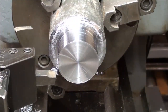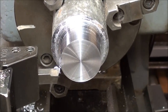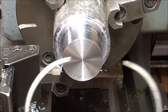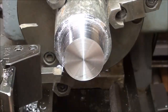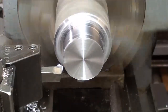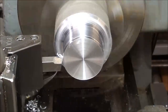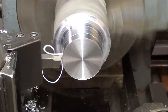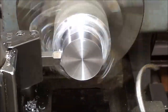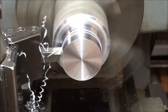I switched tools to a high speed steel tool — I like this a little better for coming up against the shoulder, and this will probably be my last pass. It's starting to look right but just barely, and boy is this lead soft. That's it, that's the right size.